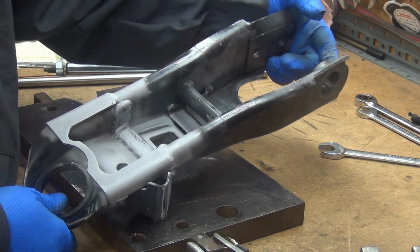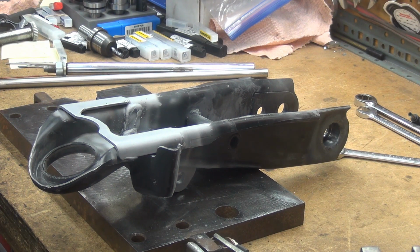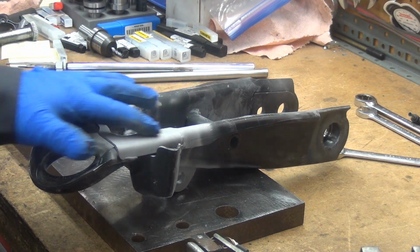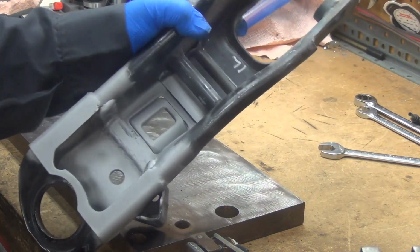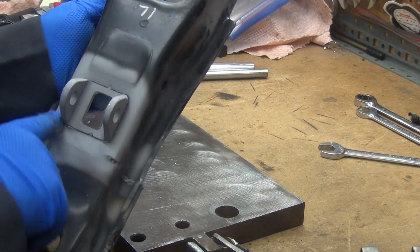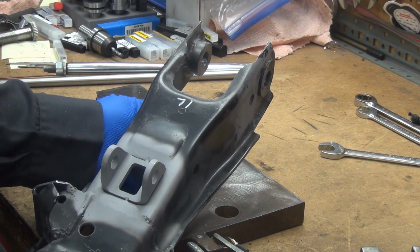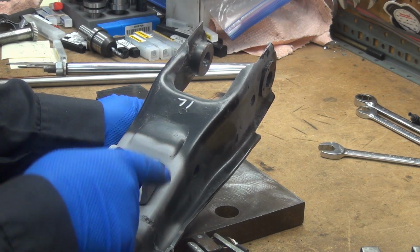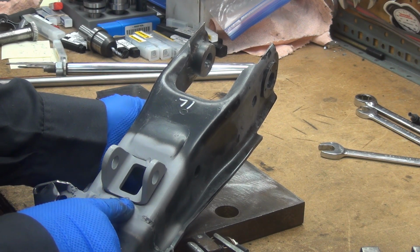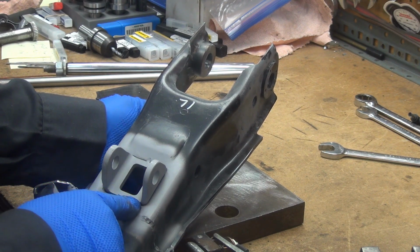It's just too much blowing around in there to see. I can barely see. So if you notice, I also sandblasted, glass beaded this part as well, and the underside, because I'm going to MIG weld under here and then MIG weld around it up here too. Once I do the bottom, I might possibly just TIG weld it. We'll see. I want to do the bottom first because then that starves the air gap in here, so I'm not getting oxygen coming up through if I were to try to TIG weld this.